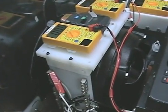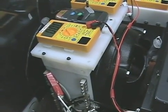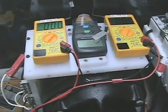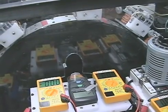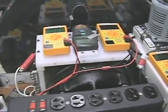The goal here is to drive the induction generator to take over for that part of the operation. The wheel is being driven by the variac until the point where the induction generator is up to speed, and then the induction generator takes over for the current being drawn. The coils push the wheel which drives the induction generator, and then anywhere from 60 to 80 percent depending on the voltage is being recaptured back into the batteries.